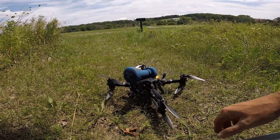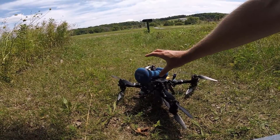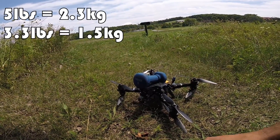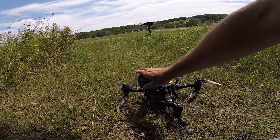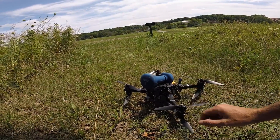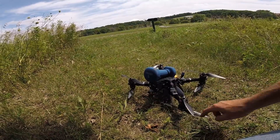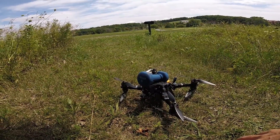So this is the Shen Drones Thicc. It is a payload drone to carry a cinematic camera for movie production and that kind of stuff. I think the cameras are generally about 1.3 kilograms. We have about a 5-pound weight. This weight is more than it will need to carry, but the gentleman that I'm tuning this for wants a 5-pound tune out of this thing, and then we'll go back to the 1.3 kilograms. You can see it's an octocopter — one motor spinning on the top in, motors on the bottom spinning out. That, of course, gives it additional lift and also some redundancy in motor control.